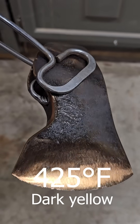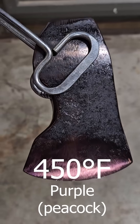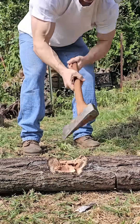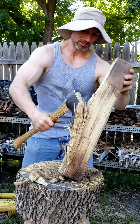As the temperature goes up, the color changes and the hardness or brittleness is reduced and the toughness is increased. And that brings us to axes, where resilience is more important than ultimate edge retention. They're usually tempered purple to blue.